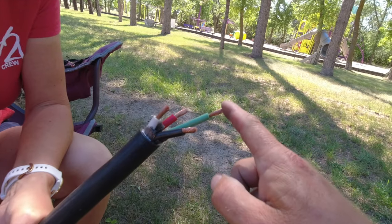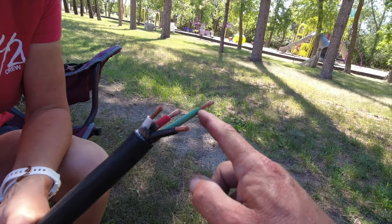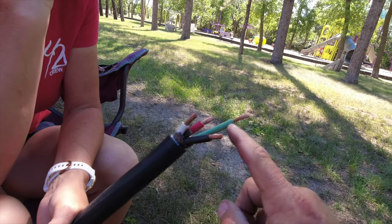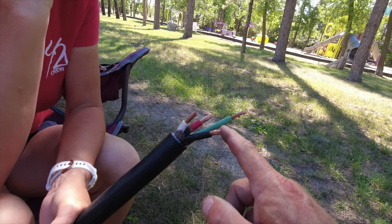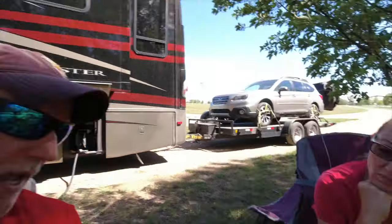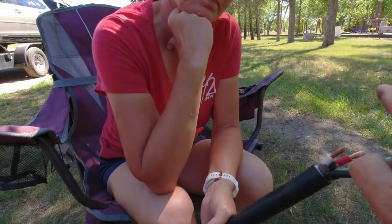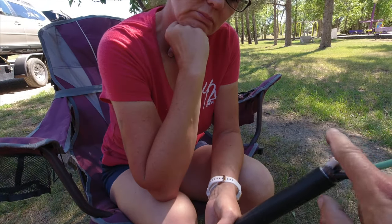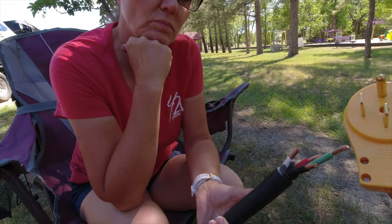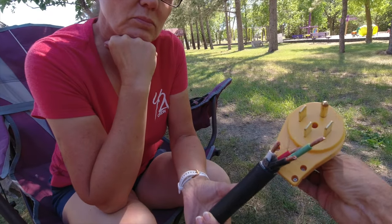The main wire is at three inches with three-quarters of an inch of exposed wire. The other wires are all 1.875 inches with 0.625 inches of exposure. Then an inch and a half with just slightly over half an inch. Now we're going to prep this and go ahead and put the new plug on.